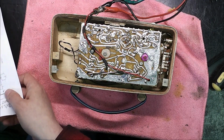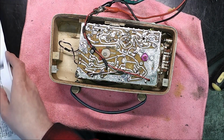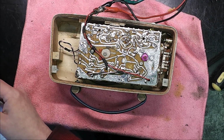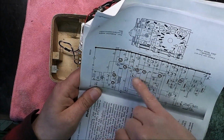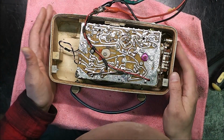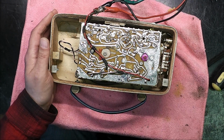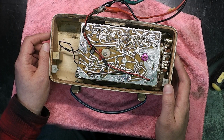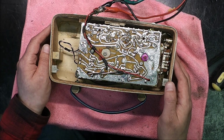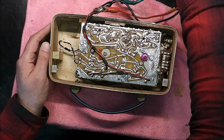I've just had a look through my radio and television books and found the diagram for a PT208, and that appears to be a little closer to what I've got with the biasing and the reflex back through the IF stage. So I think that's a bit clearer to the set I actually have got here, and of course it shows the diode bias on the push-pull output stage. So now I'm going to just use a coupling loop and just go through the procedure.